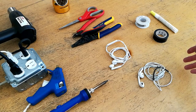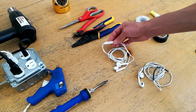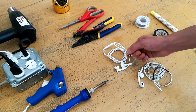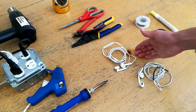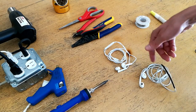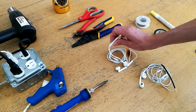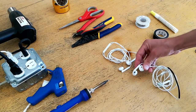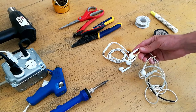Now before I start this modification, a little bit of theory as to why these are not compatible. The way that the volume control and the start-stop button in any of these headphone controllers works is it sends a predetermined code down the microphone channel of this 4-pin tip ring ring mini stereo 3.5mm jack. Because the different manufacturers use different proprietary audio signals to create that signal pathway, the different devices across manufacturers are not necessarily compatible. So what we need to do is retain the control switch for the brand of device we're going to be using while modifying the existing headphones to use the transducers from the pair that we think is more acoustically pleasing.